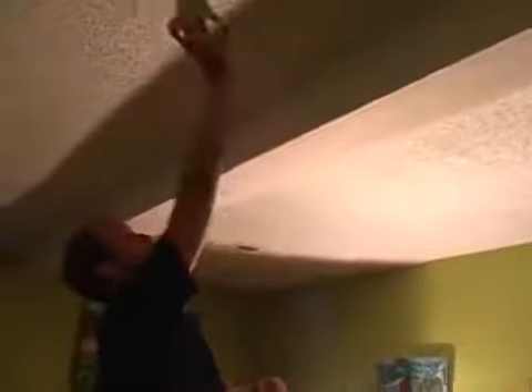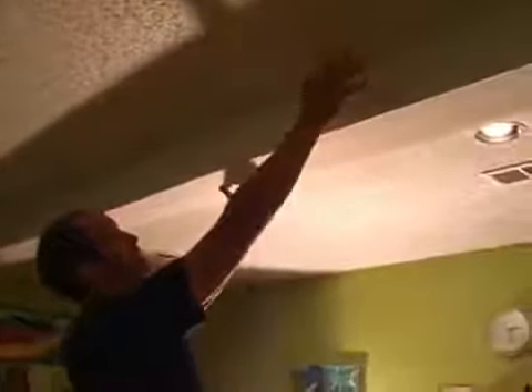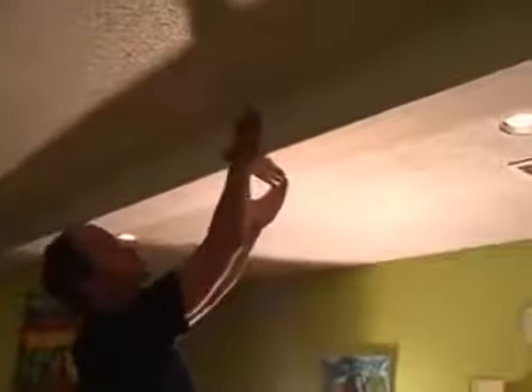Right here — remember, this is the deck area — and this is probably where the exterior wall is because of this load-bearing beam. This is where the slider door is. Old slider door. This is a 25-year-old house, original slider door. It probably has some tread problems, flashing problems, sealant problems. Could be the roof, could be the deck. And there are real faint water marks here. A home inspector just can't come in and inspect one system or component without thinking about the entire house — it's a dynamic situation.